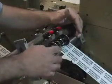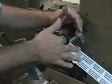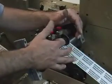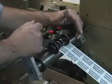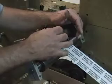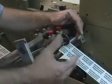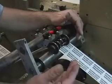Maybe this blade is real sharp, and you can start off with just the original spring tension that's here without any compression, and it's enough to cut. But over time, as this wheel becomes dull, then is when you start to use this as a method of compression. Okay? And again, always the least amount it takes to do the job. But with this, you have to be careful that it does the job. Okay? Because you're going to be sensitive.